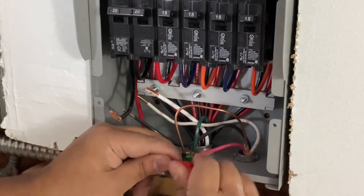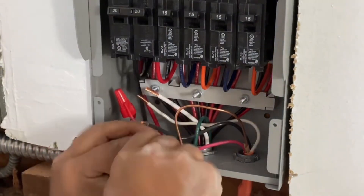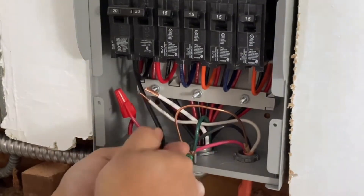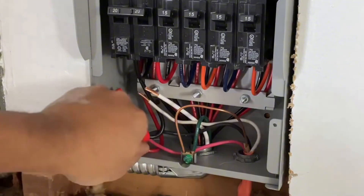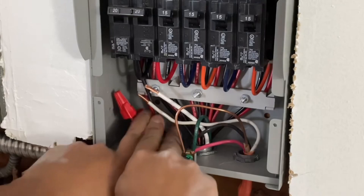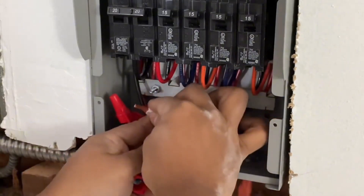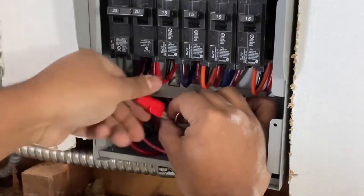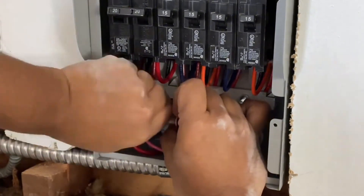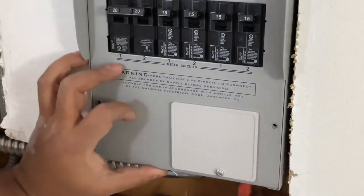Please make sure all the power is off. Nothing is connected right now, so I'm connecting and I'm going to keep the power source last. I open up the transfer switch and see these wires are not connected, so I am connecting them. Once you've got the wire nut on tight, you can use electrical tape, or before you tie up the wire nut you can use a lineman's plier and give the connection one or two twists — it will keep the wires together.